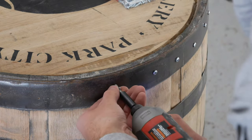Everything's cleaned up, all the hardware's on, all the new metal straps are on at the door, so now it's time to stain. I'm going to use a tack cloth first to get any dust and excess stuff off. Once I'm finished with that, I'll be applying this Minwax wood finish in the Provincial 211 color. Another YouTuber I watched suggested this color, so I'm going to try that. I'll be testing out a little portion of the door first just to make sure it looks okay, then I'll apply the whole thing. I'll be using paint and cleaning rags to apply it. When I finish with that I'll let it dry, and I might do another coat — we'll see how it looks. Then I'll let it dry completely before we put on a sealant.